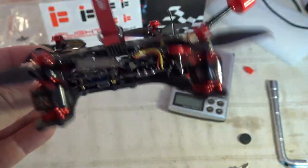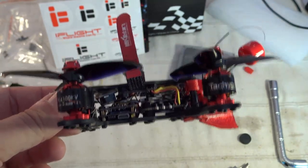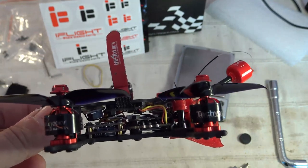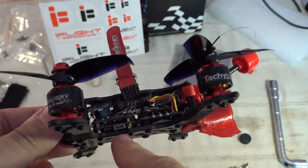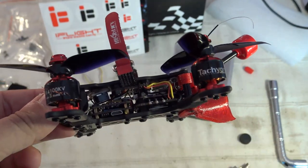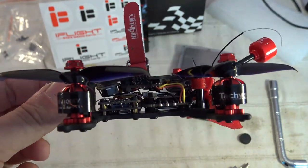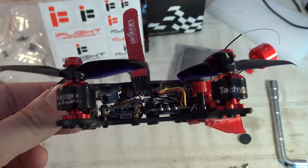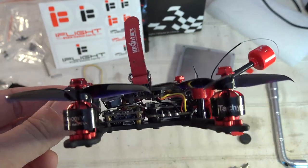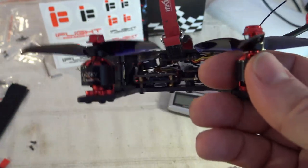Second, I will continue with the bad points, which is about the Runcam Split Mini. Since there are only two free ports, the UART1 and the UART6, there is no free UART port to, for example, make the connection between the Runcam Split Mini and the flight controller in order to control the video triggering, recording via a switch of your radio. If there was a free UART port, this possibility could be true, but it's not the case in practice.